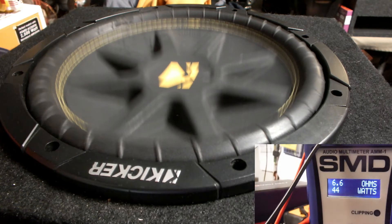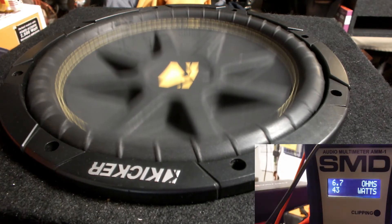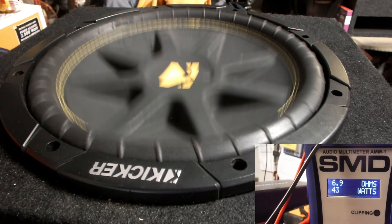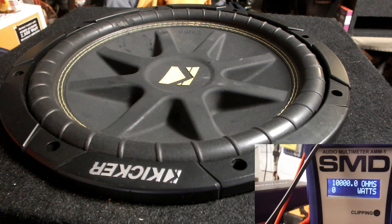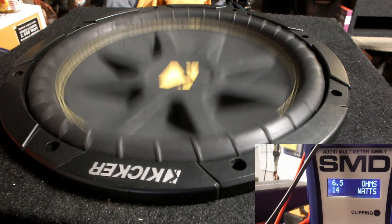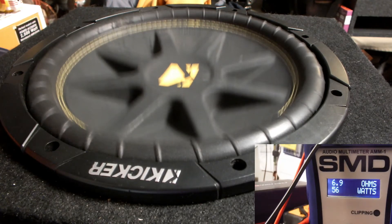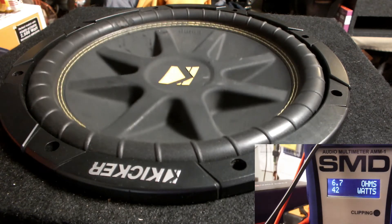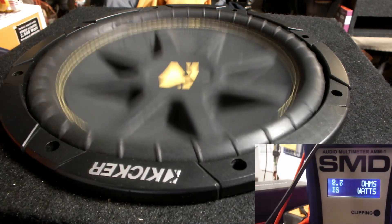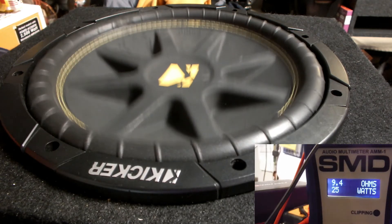So let's see how 30 hertz sounds. There's 30 hertz and we got 44 watts of power — definitely nowhere close to RMS for this subwoofer, and we're still at almost 7 ohms. Maybe the musical will do better. Let's try a music simulation. That's about 80 watts there — 125 dB. I gotta say for a little Kicker it doesn't sound that bad; sounds really good.